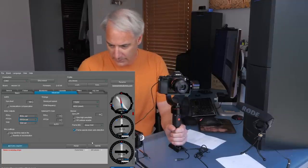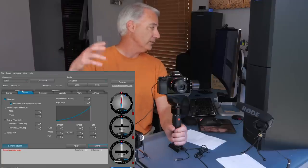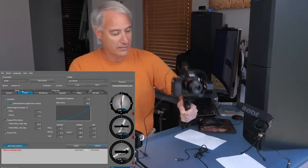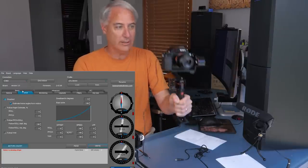Now all three axes are tuned statically. Going back to advanced and enabling roll and pitch out as well. The manual says then all axes are tuned static — try moving the gimbal frame to emulate real work, and you may notice some cross-axis interference. Yaw feels good. Roll feels good. Pitch — I knew that was coming. Sometimes I want to bring this down low and then up, and I don't want oscillation. I've had this before. Going back to basic — I know it's dampening, so I'll go down to about 23 on D.